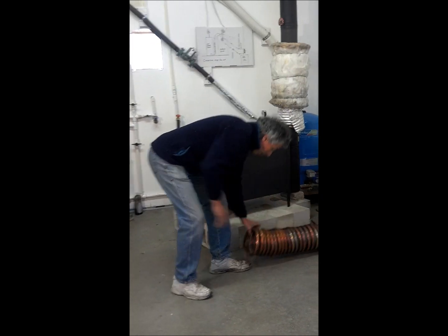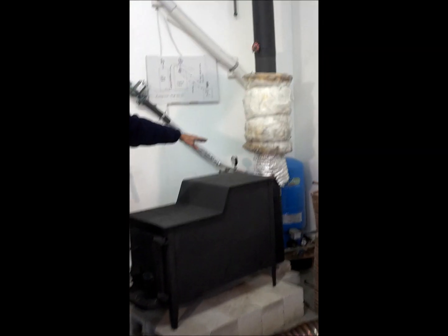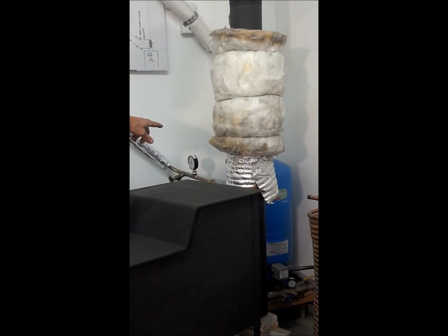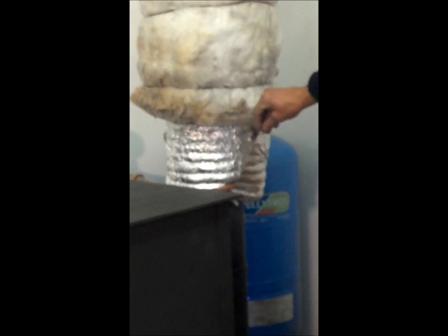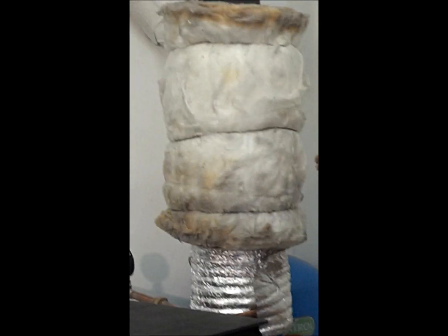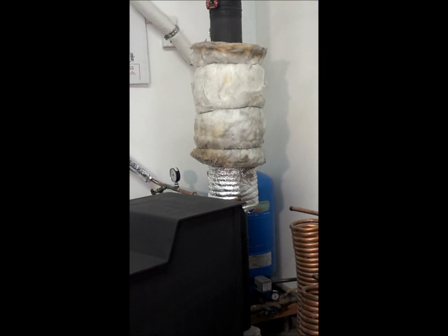That is what's sitting right there. I've actually taken away the insulation on the bottom. One of the key factors I found was you have to insulate that coil or it doesn't work. What I did initially was simply wrap it in aluminum foil — you can see that underneath. Let me pull this back a little bit — there's your coil there. I removed the bottom insulation to show you that. Then I just wrapped simple unfaced insulation around it and held it with mechanic's wire. That's all I did initially — it works fine.